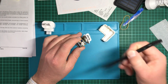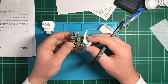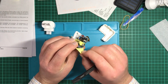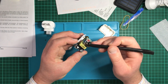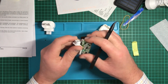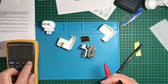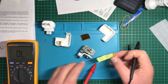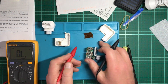Taking a closer look, you can see this electrolytic capacitor here — I kind of damaged it. I really wouldn't want to try putting this back together and using it. Let's take a look behind this tape. Here's something interesting: we have what looks like a transformer here and another one here, although one of these might be a choke. The way to figure that out would be using my multimeter — it could just be a coil. The sticky side of the tape is also covered with whatever that brown stuff is.